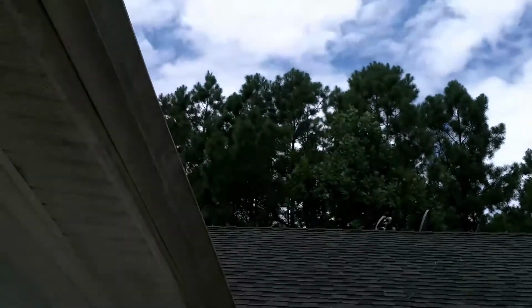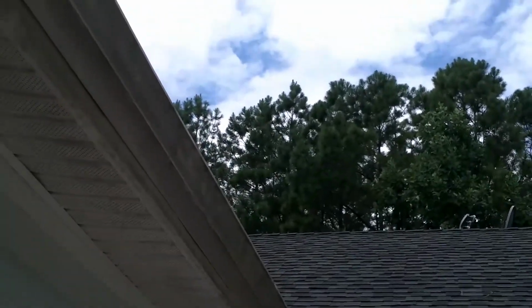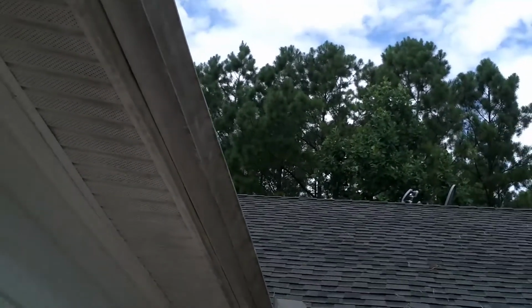One of the things that I did, where it would bear the most weight of water, I leaned it so that it leans up rather than out. That'll put the weight back near the roof joists and the fascia rather than at the outer edge of the gutter, which will cause the weight bearing to be more vertical than horizontal.